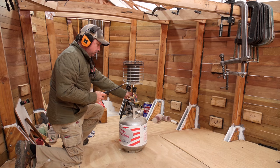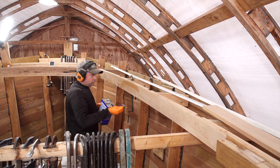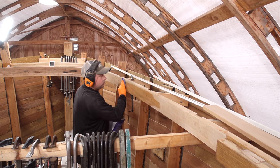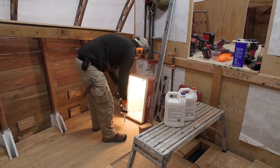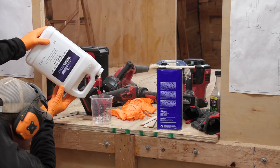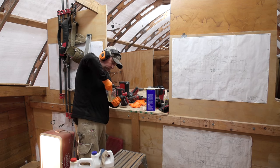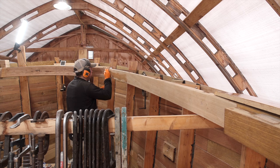With the stock surface prepared for epoxy work and our boat shed nice and toasty, I was ready to do the glue-up. I'm only comfortable doing about two layers at a time — I probably could do more, but I know I'll get a good result by just doing the first two layers at once. I'm using TotalBoat's high-performance epoxy here again because I know it works well with white oak, and it also has a lower operating temperature, so I'll get a full-strength cure in lower temperatures — down to about 55 degrees, which works well since I've got the boat shed up to around 60.